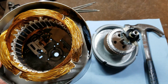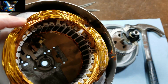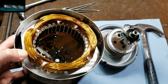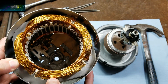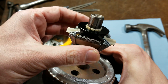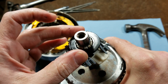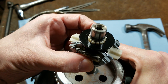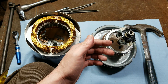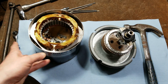By default when it's turned off, that switch is in the on position, so this extra thin startup coil is actually engaged. When you turn it on, that helps provide additional phasing to get the motor started and provide startup torque. But once it gets spinning, it interferes with operation at speed. So it has two little counterweights, and as it speeds up these counterweights spring out, retracting the switch ring. This little ring is like a piece of polycarbonate gliding over the finger of the switch, and as soon as it gets up to speed it retracts, turns off the switch, and disables that second winding. It's a real simple and fairly reliable means of eliminating a capacitor for an induction motor — though I think it ends up harming efficiency a bit. That's kind of interesting to see.